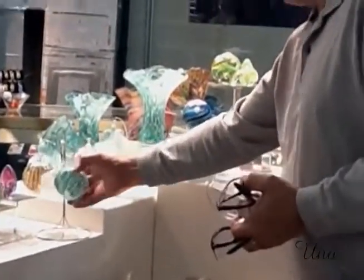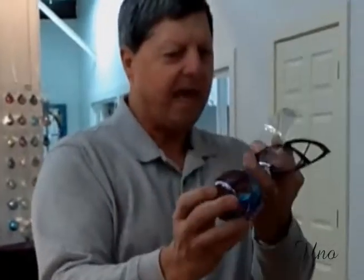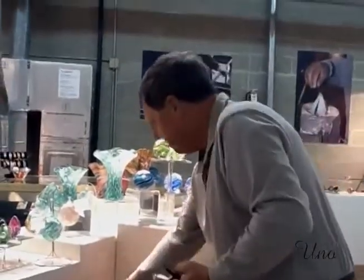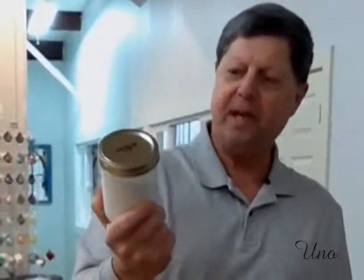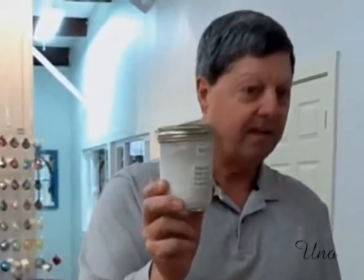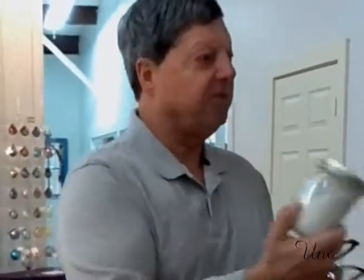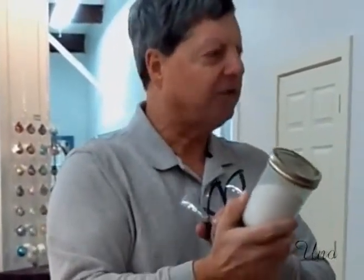When we're making a paperweight, it's so important that we have perfectly clear and as nice of glass as we can, so that you can see through it, because the designs are always on the inside. Right. So when we make those, we use this. This is called batch. Well, this is about 75% silica sand. Then you add soda lime and potash to it. We put this in the furnace and melt it, and it's the clearest glass we can get.